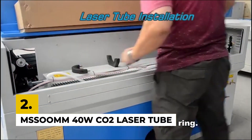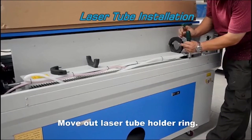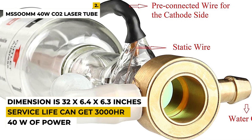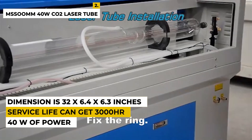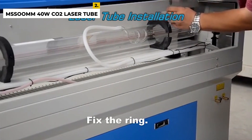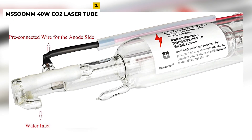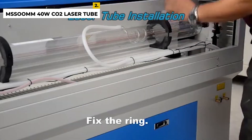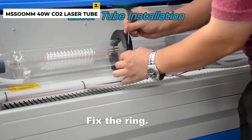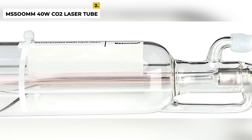The second number is the MCL40W CO2 laser tube. The product has 40W of power with an outer diameter of 50 millimeters and a length of around 700 millimeters, and there are many different sizes available with prices differing by size. The laser tube adopts an inner discharge tube coated with nano gold catalyst, which increases power and provides a service life of up to 3,000 hours. The original positive and negative wires connect to the corresponding joints of the laser tube, and insulation can be sealed with high-pressure tape or 704 silicon rubber. The dimension is 32 by 6.4 by 6.3 inches and it weighs around 3.04 pounds.